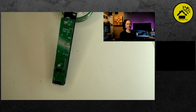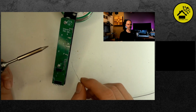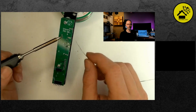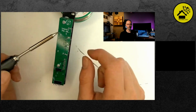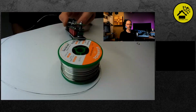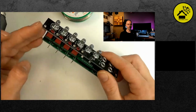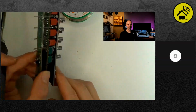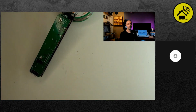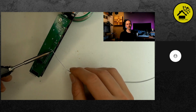Just not nice. All right, so I will solder one pad first. I do it on all four, so I just have to turn it once around. Okay, and have a look. Looks perfect. I mean, moving LEDs forth and back is still quite easy because you have only two legs, two solder joints.